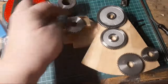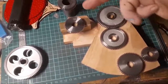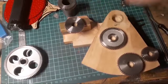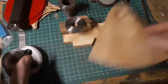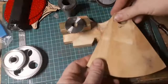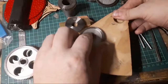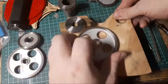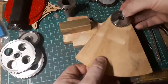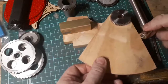So there's a pair of tumblers going here, and we're still waiting for these gears. I just ordered them. I probably could have cut them, but it sounds like work. And they were available really cheap. So the tumblers here for reversing, and then this quadrant has three slots in it like this, I hope. And this is adjustable, I hope, up against this gear with idlers, whatever. And that drives through to this one here, which is the pivot point, and that drives the shaft through to the compound. So